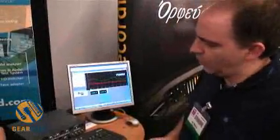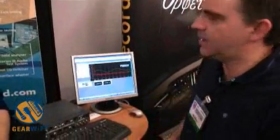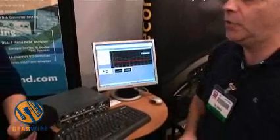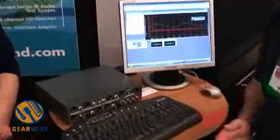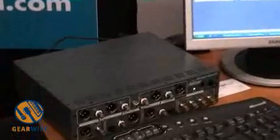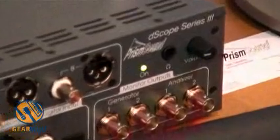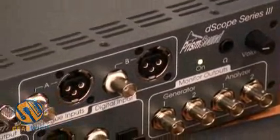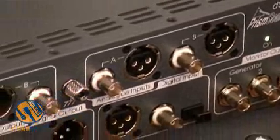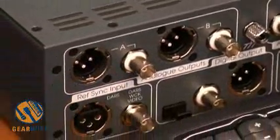This is another area of Prism's business and one that we're a lot less famous for. This product here is called the D-Scope, and it's basically an audio generator and analyzer for both digital and analog audio. It's used by guys in research laboratories who are trying to develop audio products, both analog and digital, and they need to measure the performance of them with great accuracy. We're looking for levels of distortion way below 100 dBs, noise floors 100, 150 dBs down.